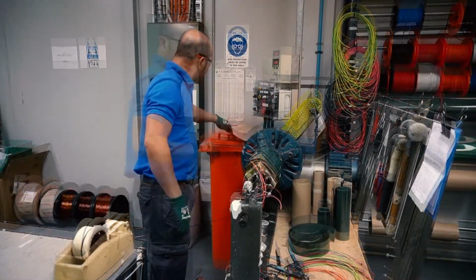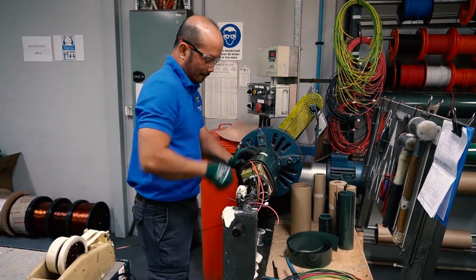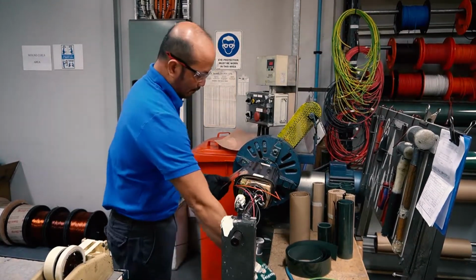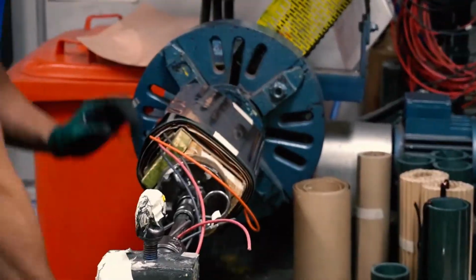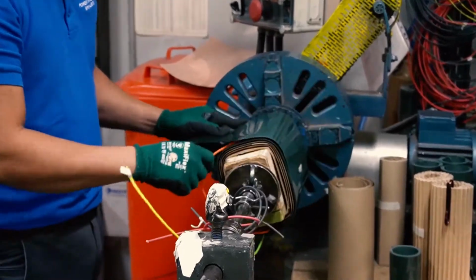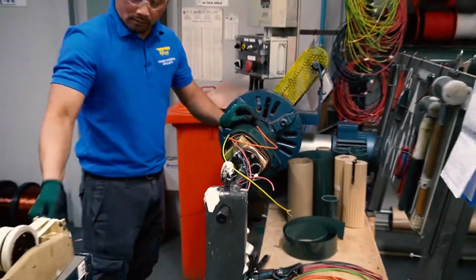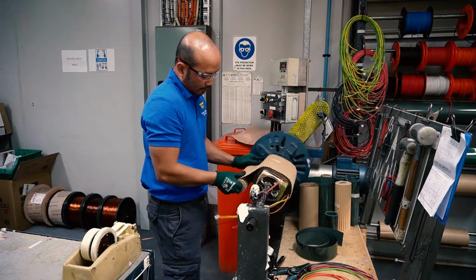Then after that, I have to put a shield between, as required, the primary and the secondary winding. So just simply connect a thin copper around the primary winding, and then again another 3 wraps of high ply, which is prior to the secondary winding. I have to wrap with a corrugated material as required.